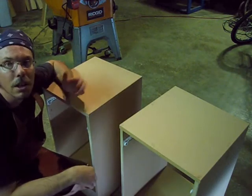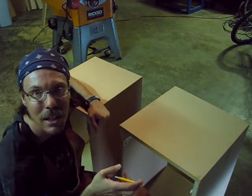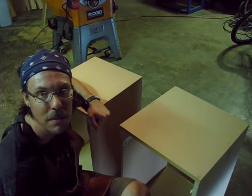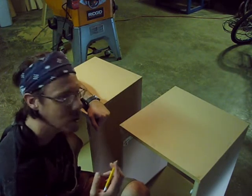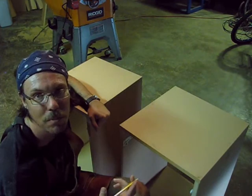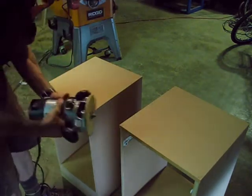Okay. So the thing about a 3/4 inch roundover is you can't really do it with a handheld router, because the board's 3/4 inch wide, so there's nothing for the pivot bearing to ride on. But luckily we have the router table, so we're going to go back there and cut those 3/4 inch roundovers with that. But we will do the 1/4 inch here because we already have that router set up, and we'll get that over with. So we're right here. Let's go ahead and cut those.